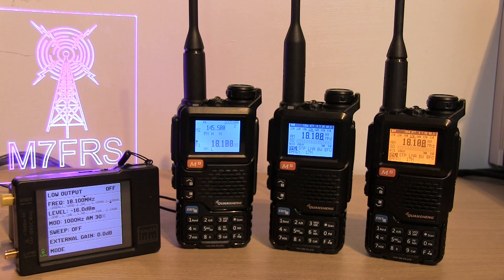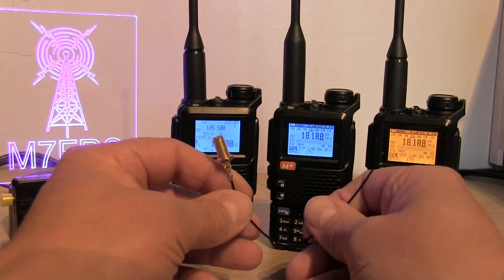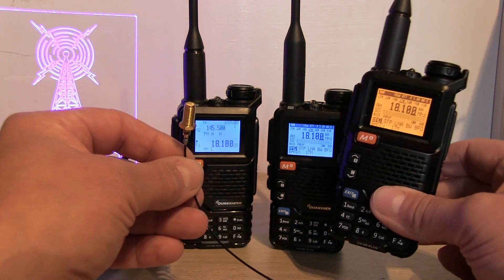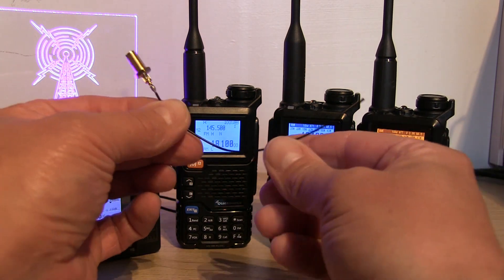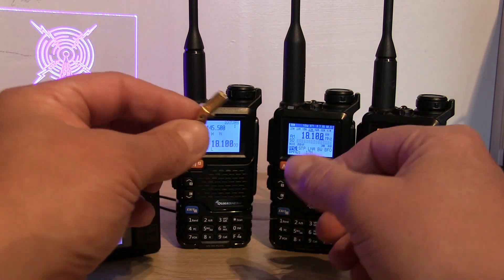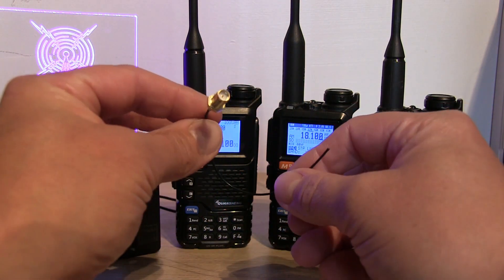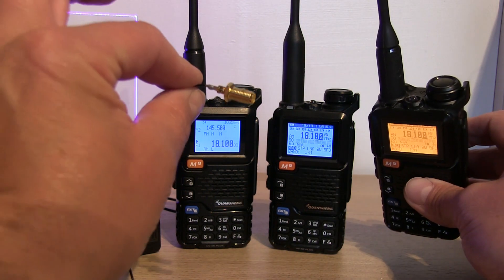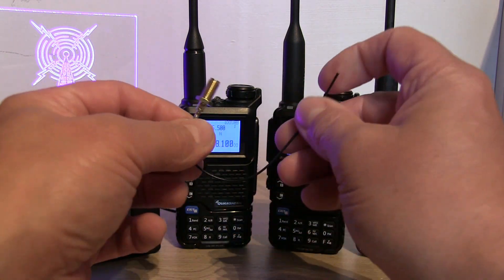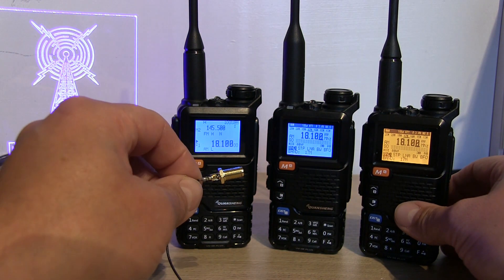So there you go — that's a demonstration of the UV5R Plus and how it performs either unmodified or with one of the two modification boards, all running standard antenna connections. The second generation board has an external antenna input, and I've bought a couple of little SMA sockets which may well fit where the LED goes. In a future video we'll have a go at fitting the SMA connector within the casing — it's just got a really fine thin piece of coax attached which we'll connect by removing the little capacitor and putting it in place.